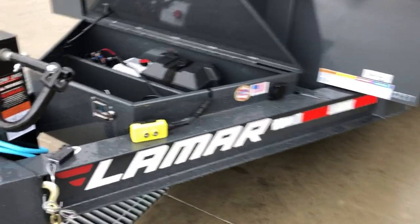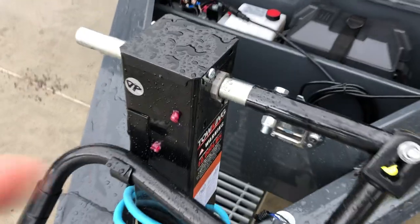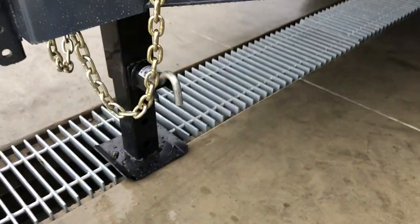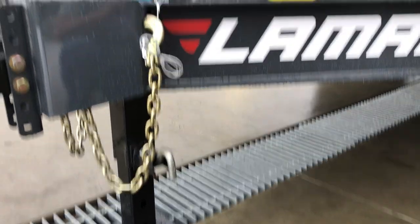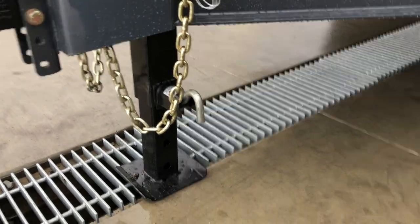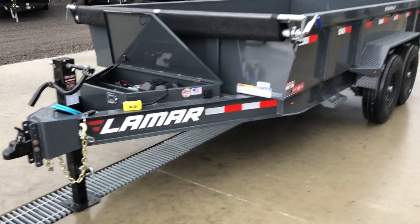The toolbox is lockable. Up front it's also got a 12k jack with two grease zerks for serviceability. If you've never had a 12k jack, it's spring-loaded — simply pull your pin at the bottom. There's an inner leg that will adjust and then your handle will adjust the outer sleeve. No need to ever have blocks of wood or similar; it's got plenty of adjustment.